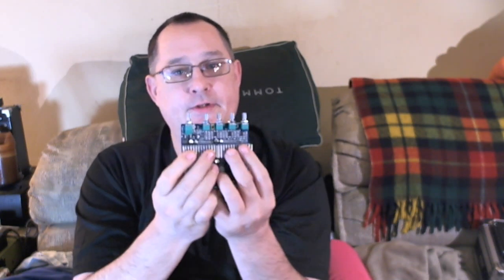But yeah, the heat sink is held down by 4 screws, because there's 2 of those TPA3116D2 chips in here. There's one here and one here. One of them runs the right and left channel, the other one just runs mono for the bass output. And the controls are master volume, treble, which adjusts the treble for the right and left speakers, and then a treble volume, which is actually volume for those speakers. Then there's frequency and bass volume. So this is the volume for the subwoofer, and this is the frequency for the subwoofer.